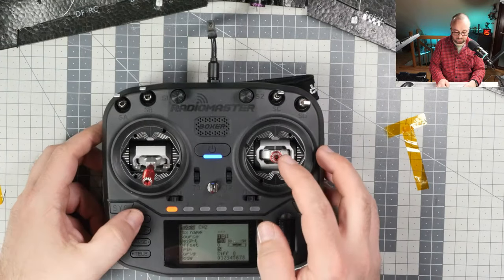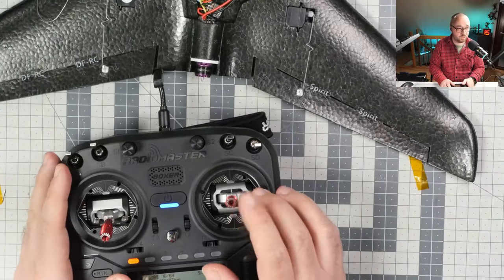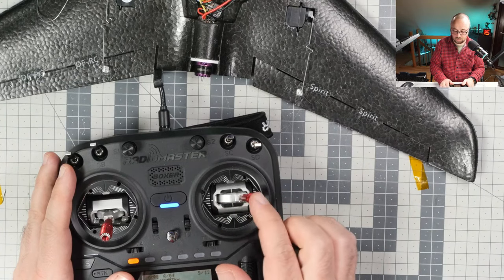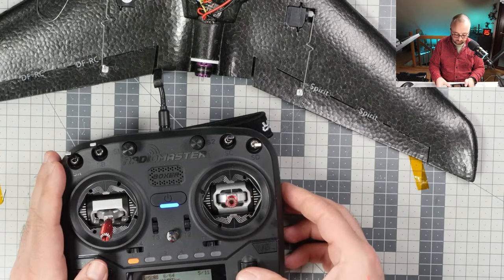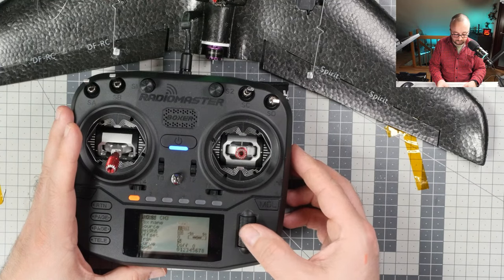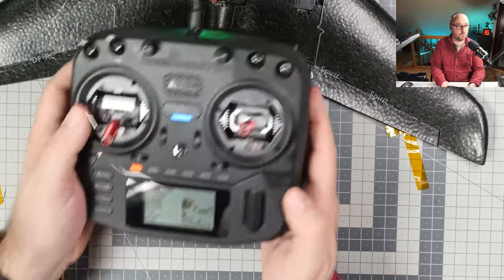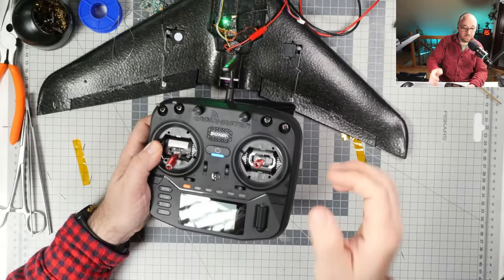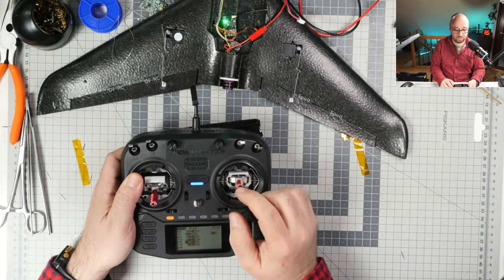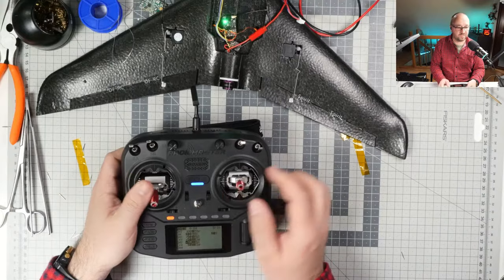Yup. Fantastic. And on the right servo, we should have... elevator is correct, but aileron is wrong, so have to reverse the aileron on the left servo. Fantastic. So let's try to run the high five test again. If now everything works, both went up, both went down, right one up, left one up. Fantastic. You see? It's working.